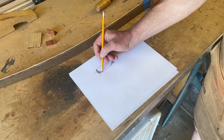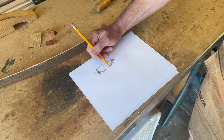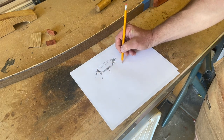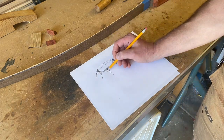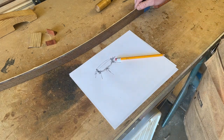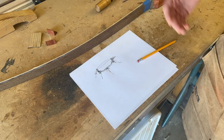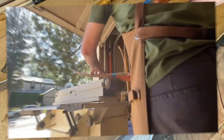Now, as we start approaching some tillering opportunities, that's when we start removing here. This is where we tiller, is on this edge here. All of our weight is managed here and here. This is where we get our bow bending at the weight that we want. This is where we get it bending in the shape that we want. And it's important that we approach those two things independent of one another. That way, we're not chasing the shape of the bow at the same time as we're chasing the weight of the bow. Because when you get the two confused, you end up with a mess. It's a pretzel that weighs 20 pounds at 28 inches.